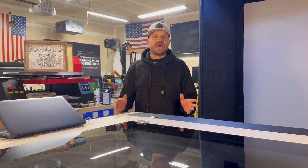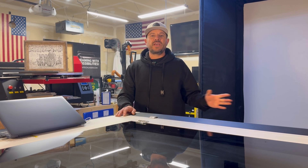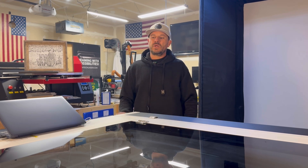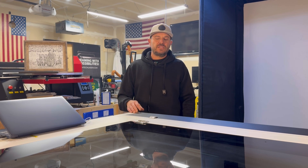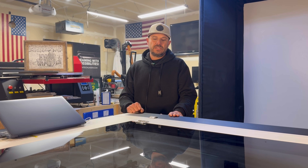The ideal way to use the Hydra 9 with both laser sources: say you have a job that has engraving and cutting. You want to engrave with the RF tube to get those high details at high speed, saving you time, then cut it out with the glass tube. Today we'll focus on engraving, but toward the end I'll show you how it switches the mirrors around to use both tubes in one job. I can't show the mechanics behind it yet since patents are still pending, but we will show how it works inside the machine.